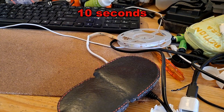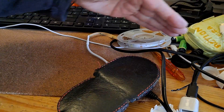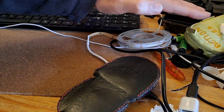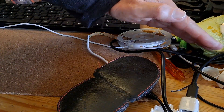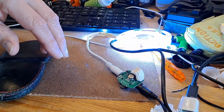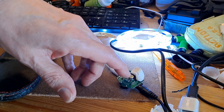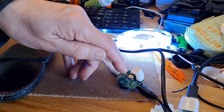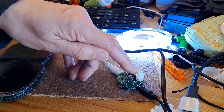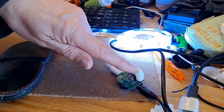I've got it set to five seconds and it is turning itself off again. If it sees me again within that five seconds, it doesn't turn off. I think it's also got a delay — it doesn't re-trigger straight away when it has turned off. So the silver bit is the PIR; it's actually written on there, PIR. And then the LDR — light detecting, or light dependent, resistor. I've got black tape and blue tack over it to ensure that no light gets to it, because in the previous video I just held my finger over it and that clearly didn't stop enough light.